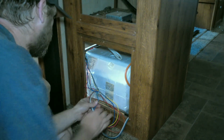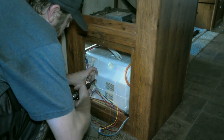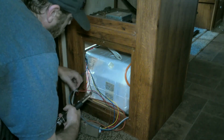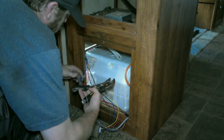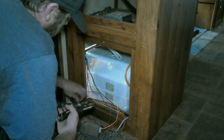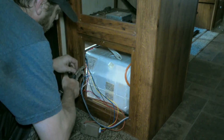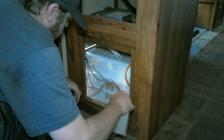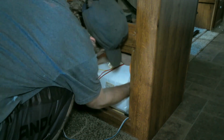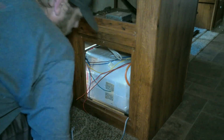Connect these Husky vice grips, I do believe. Have cutters. So I'm leaving little pieces on here, so I know which wire goes to what. There we go. All of this should come out with the hot water heater. And then once I have it out, on the outside there is when you can disconnect. Oh yeah, you gotta disconnect the 110 from out there.